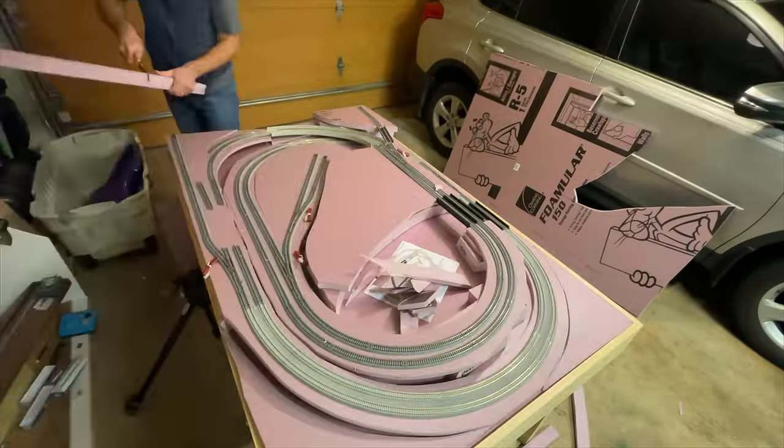Since the street lights and other small LED lights use very thin wire, if you do decide to cut the wire to length, you need to strip off the coating in some way. And while you can try to strip it off with a knife or wire strippers, you probably won't have a lot of success because the wire is just extremely thin and easy to break. So the easy way is to take a lighter and simply burn off the coating on the ends of each of those wires. That works great, and it's far easier than trying to manually strip the coating off.